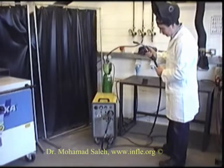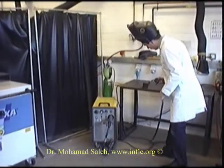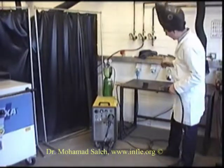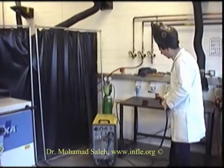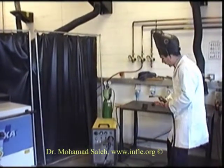The idea of the CO2 welder versus the arc welder: with a MIG welder you normally work away from yourself, whereas with a normal stick or arc welder you can work it towards you. When doing a vertical weld with an arc welder, you start at the bottom and work up.